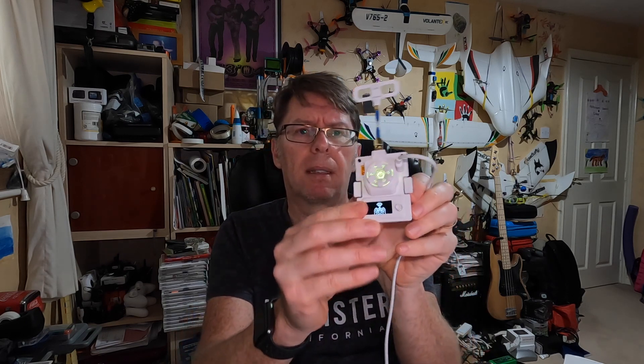There's a way of handling criticism and that's not it. I got a previous nano module from BetaFPV that was missing components so it would not flash over Wi-Fi. I had to disassemble it to get to an internal button to press to flash it. So their hardware isn't exactly known for being the greatest, and at the time of release this thing was running its own firmware version — it wasn't on the regular Express LRS firmware.